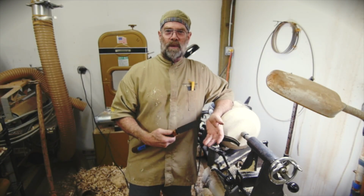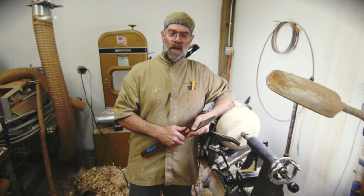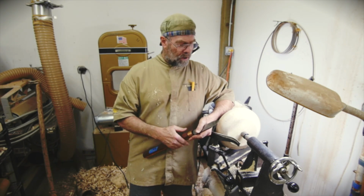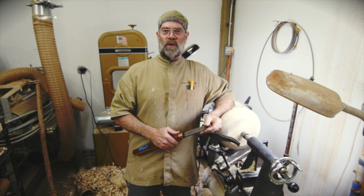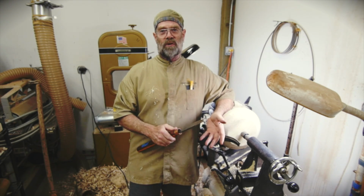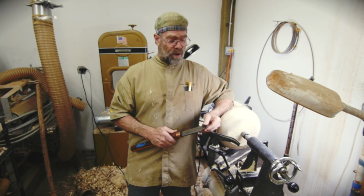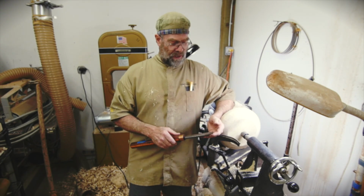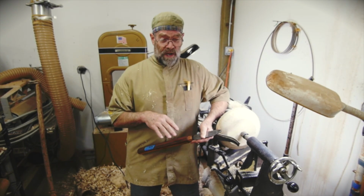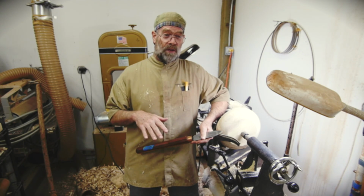Okay, so shear scraping, basically you're pulling off all these little tool marks, all the little bumps and ripples that you leave when the gouge is not working quite up to par. And of course the next question that comes up is what kind of edges do you like on them? My preference, I started off just going off the 80 grit CBN wheel, leaves a nice big heavy burr, and that works. And I've started playing around with a number of different edges. I do like a 180 grit or an old broken in 80 grit wheel. That'll take care of most of the cutting that you do.